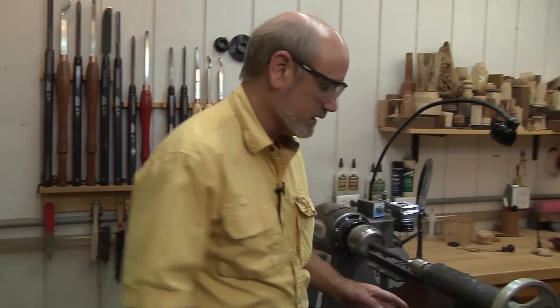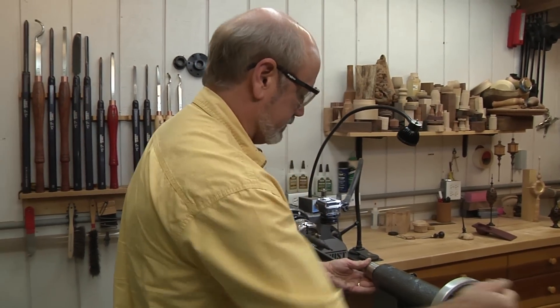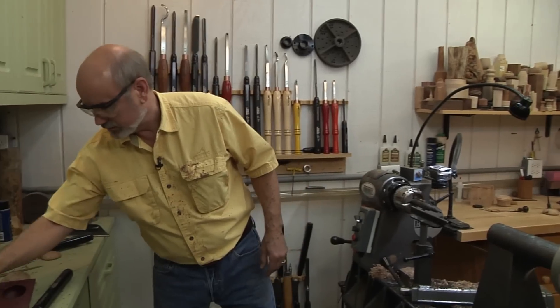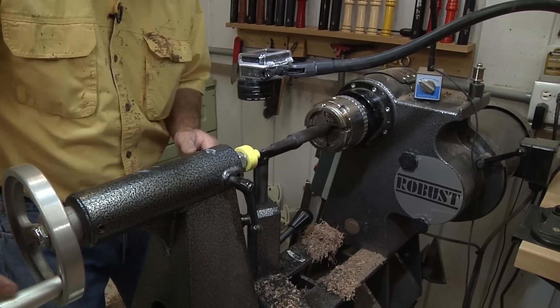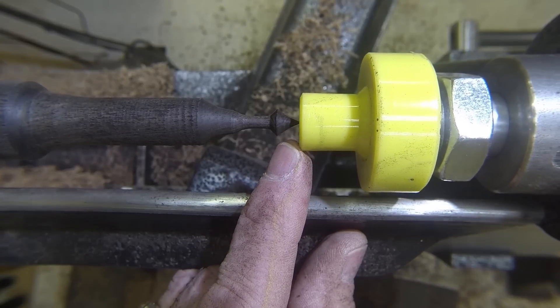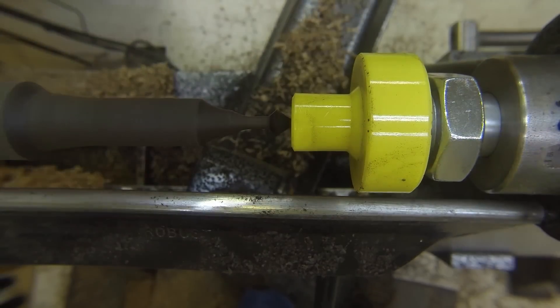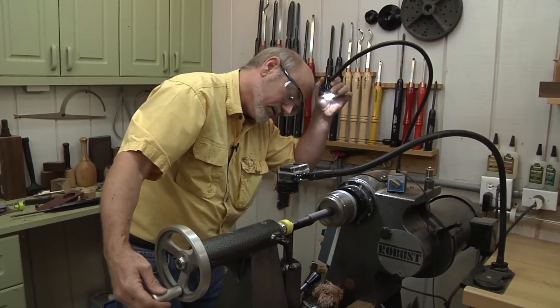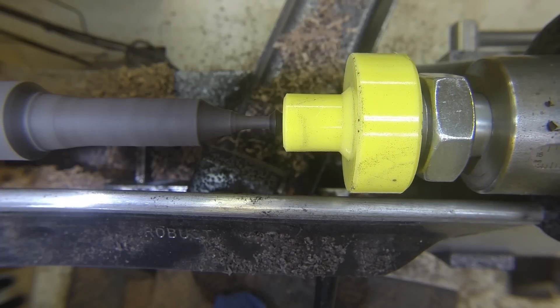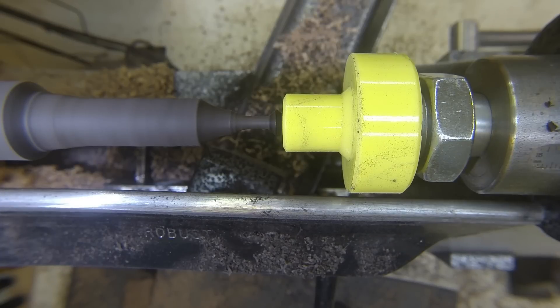Let's go ahead and change out to the chucky and I'll show you how that works. I'm just going to undo this and back it off — there's an ejector in here that pushes that out. Then we're going to take our chucky, put it on here, push it down, and advance it in so you can see how it's going to go right in that little hole. I'm going to turn the lathe on and watch this carefully. I can see it's turning now — that's all the pressure I want to put on there. As long as that's turning, I'm good. I'm going to sharpen my tool, freshen up the edge, and we're going to come back and start attacking the rest of the finial.